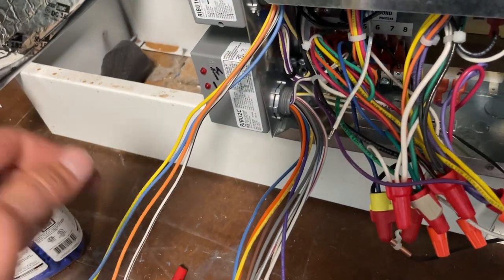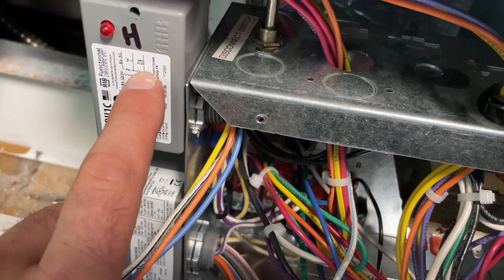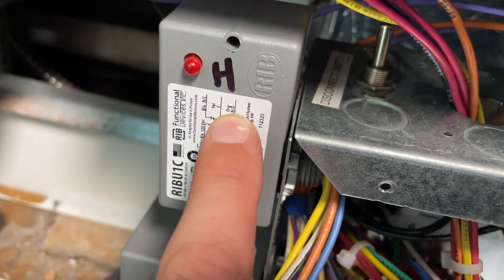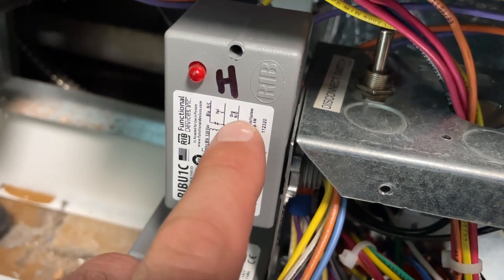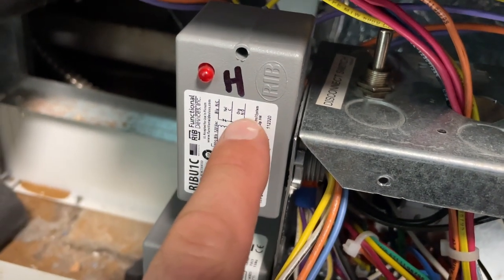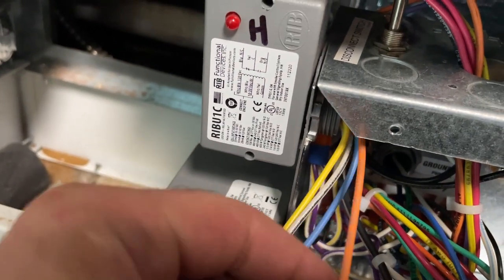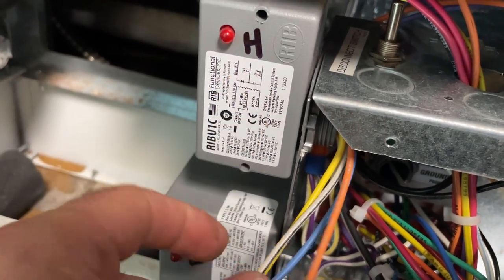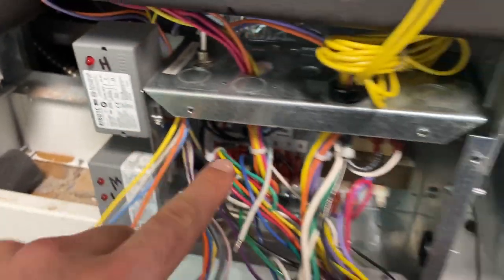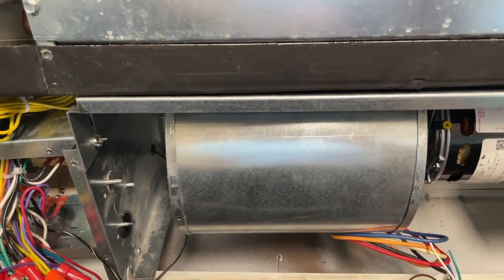And then of course, I'm gonna have mains coming in on one of these. I'm gonna do normally open. And if you don't know, the normally open, that's gonna be the state of the relay when it's non-energized. So I want it normally open. Mains is going to come in here and it's going to go out this common, or either way, I'm going to put mains here and come out, and then that's just going to feed the high up into there and run that motor on high.